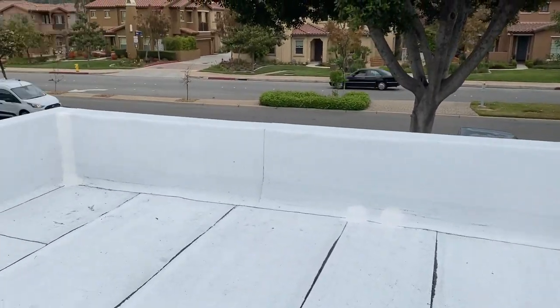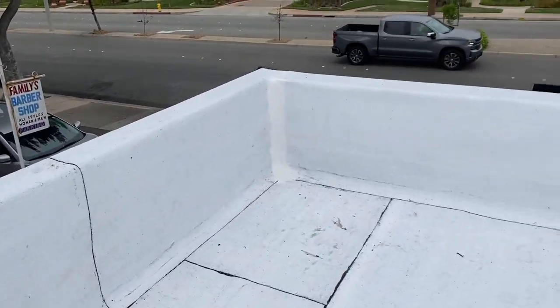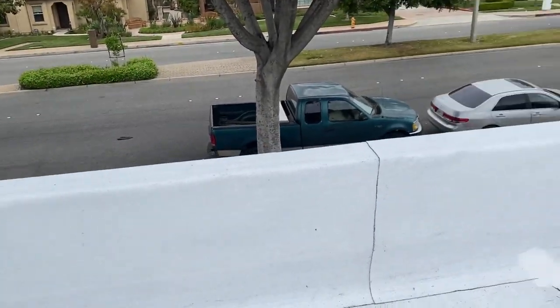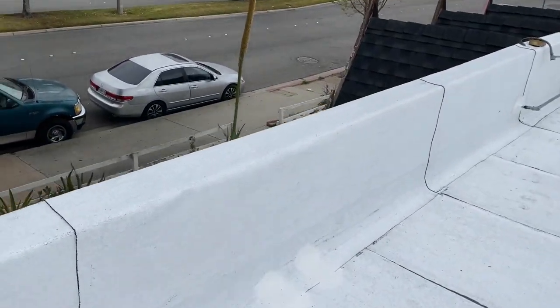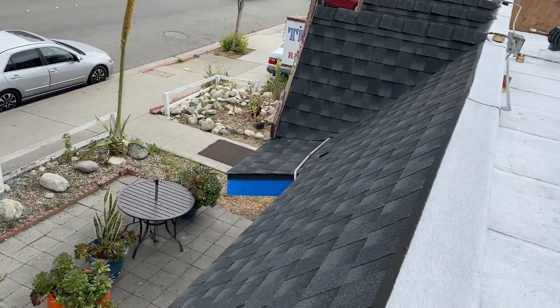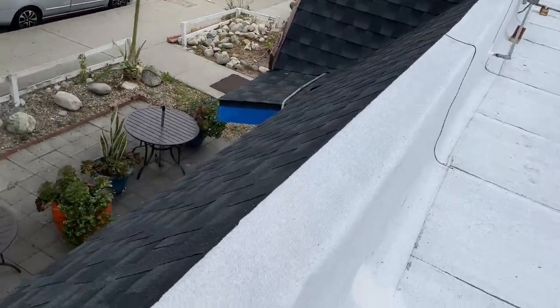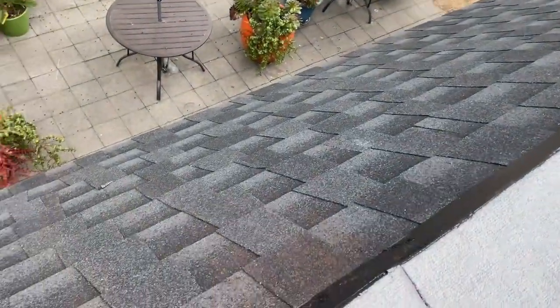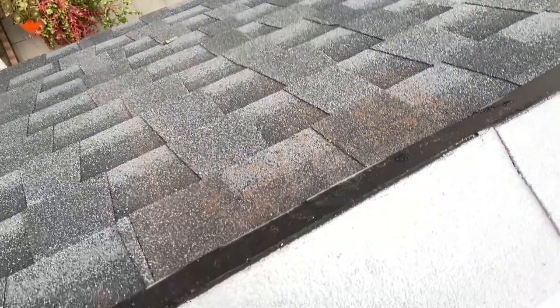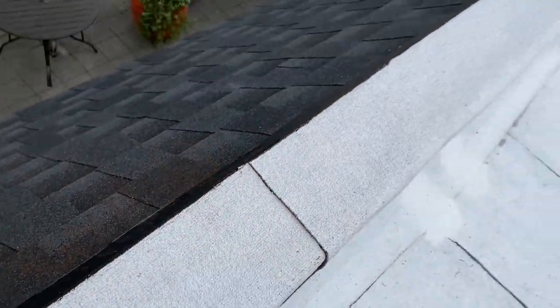YouTubers, I'm done. Eric Garcia. Here's another flat roof — this is a commercial one. I install shingles on the slope and then torch-down on the inside. Right here I finish it with the roof-to-wall flashing. I put four inches on top of the wall and then two inches on top of the shingles.